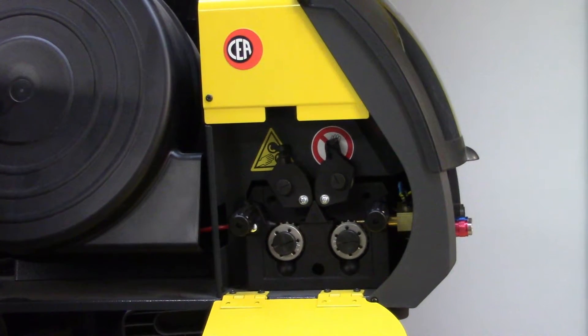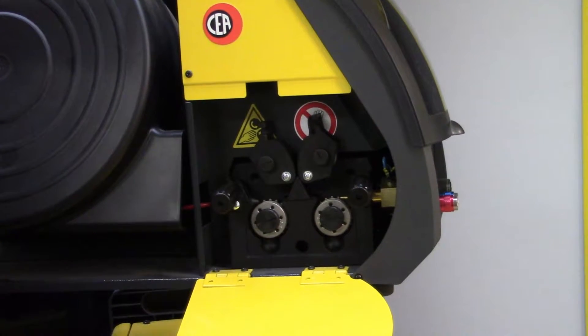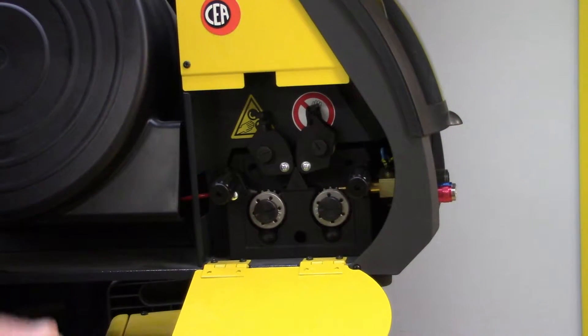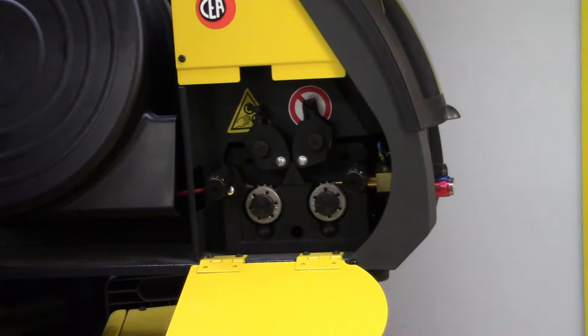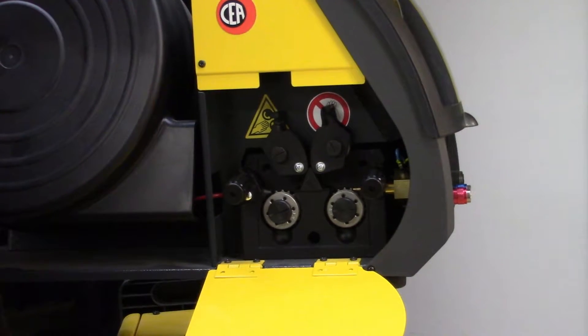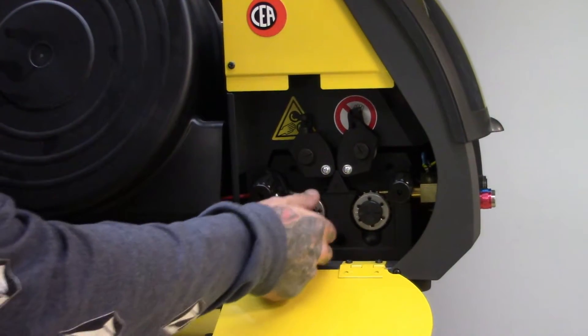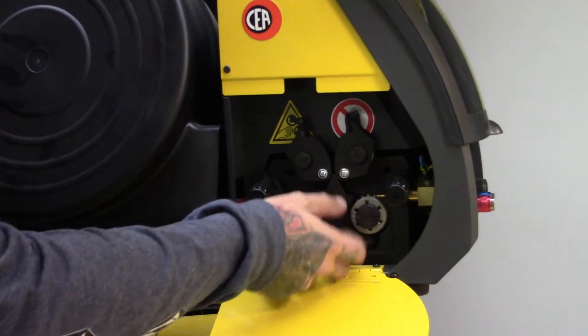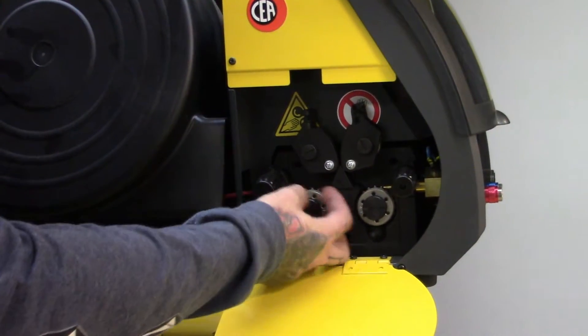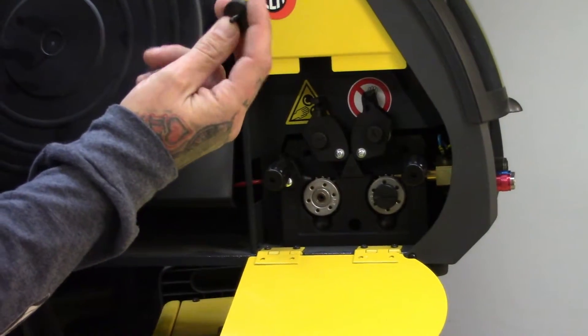With the quad-wheel drive roll system, it allows you to use fatter MIG wire and it will feed super smooth. Sometimes when you have these full-on spools of wire, they can be quite heavy and just two wheels isn't enough — it will slip a little bit and affect your feed. With four wheels, you can ensure a nice smooth feed when you're welding on really heavy stuff with really heavy MIG wire. This is a gorgeous drive roll system. That just feels well-made. That's beautiful.